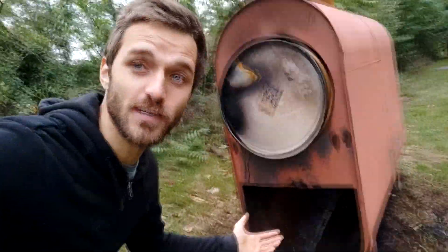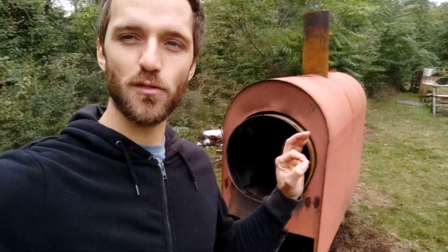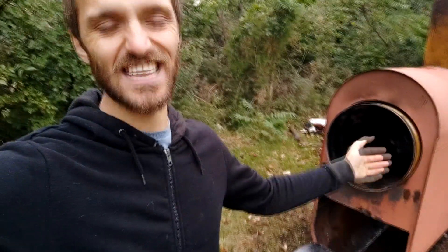The pyrolysis was a good success — all of the biomass inside the chamber has turned into beautiful charcoal. But let me explain the funny aftermath. After a whole long day when the fire turned to ashes I was eager to see the result. As I opened the lid I saw all this beautiful biochar inside and then just left it for the night. But the hot chars ignited all of the charcoal — it burned into ashes and I came in the morning to an empty reactor.